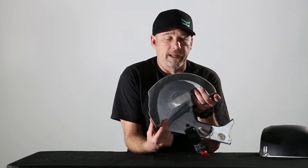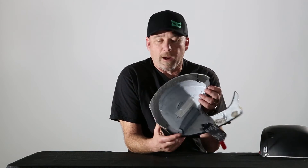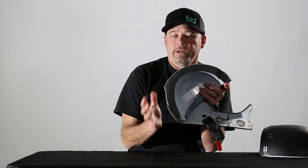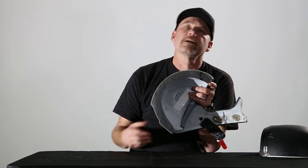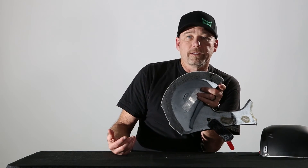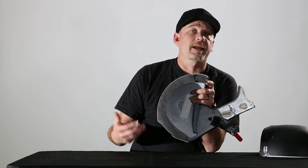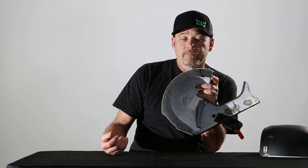What we wanted to do with composite fusion was eliminate the gap between the foam and shell — eliminate that double spike. So what we did is we took on the task of in-molding, injecting the foam in place. That process had been developed for simple bicycle helmets years ago, so why didn't people do it before? It's a processing problem. With an enclosed unit like this, you couldn't get the steam and pressure back out that you have to put in, which is part of the process of expanding polystyrene foam. That simple question actually took us three years to solve. It takes more time and cost, which is the biggest reason other companies and factories haven't done it. We believed in it so much we kept fighting through it, and we keep getting better and getting that process time down.